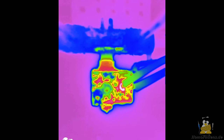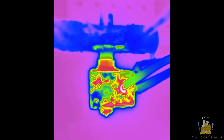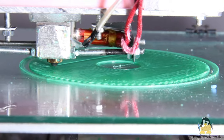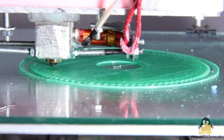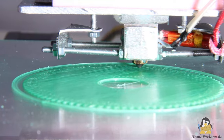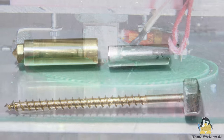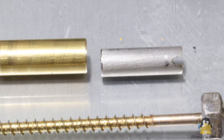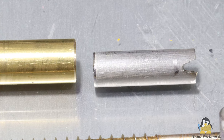There is heating at the bottom and cooling at the top. To put it bluntly, heat flows from bottom to top. The more heat flows, the more heating needs to be done at the bottom and cooling at the top. In my previous extruder designs I implemented a glass block as heat barrier — that worked, but it was tricky to recreate because the heat flow determines whether an extruder works or is extremely sensitive to clogging issues. In the all metal extruder, the stainless steel takes on the function of the heat barrier. With around 25W per meter and Kelvin, the thermal conductivity of stainless steel is only a fifth of that of brass.